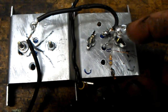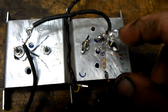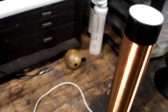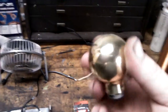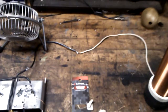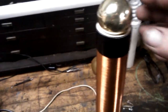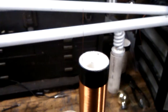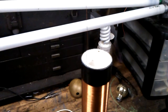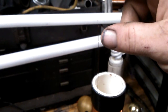The LED you see here is a jumbo red LED, and it actually doesn't start coming on until about 30 volts with a top load. The top load is just a typical doorknob — fits nicely on there. I run it with and without it all the time just to see the plasma brush. It's quite nice — I get about one inch from it.